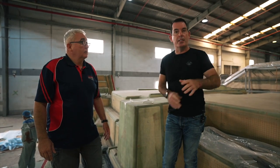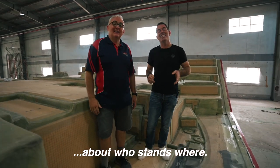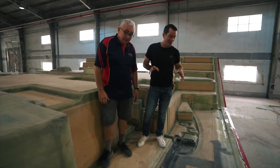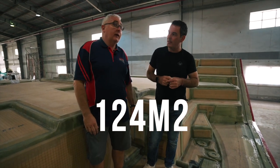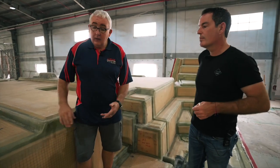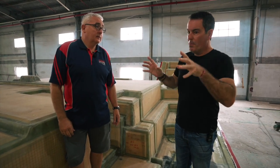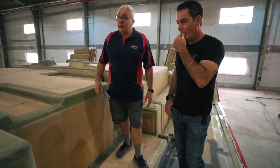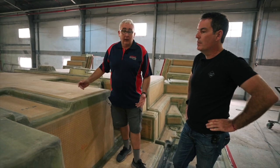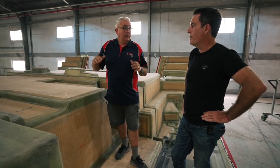The size of this deck: 124 square meters, including all of the saloon area and the main deck. It's the most complex boat of this level I've seen. The reason for such high square meterage is that the saloon furniture is incorporated into the deck mold. Unlike other boats, there's also a separate coach roof and window mold that then goes on top. The internal furniture molding is built right into the deck.